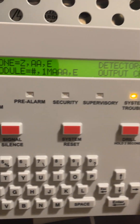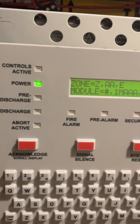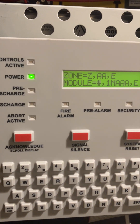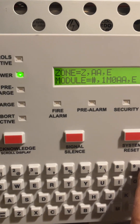You'll see the blinker on screen. On a 2640 panel you can select loop one or loop two. On a 320 you only have one loop, so there's no option. In this case we only have one loop installed, so we'll enter module 001.